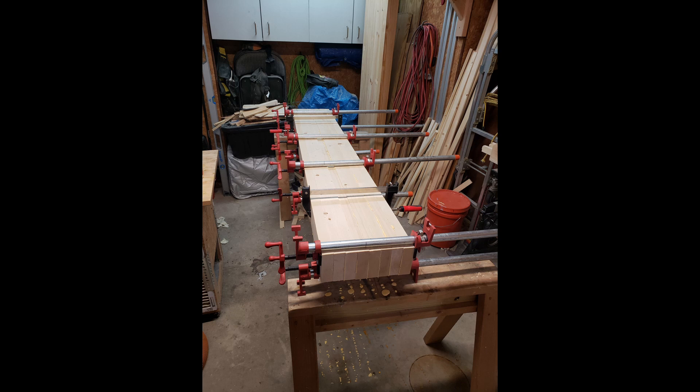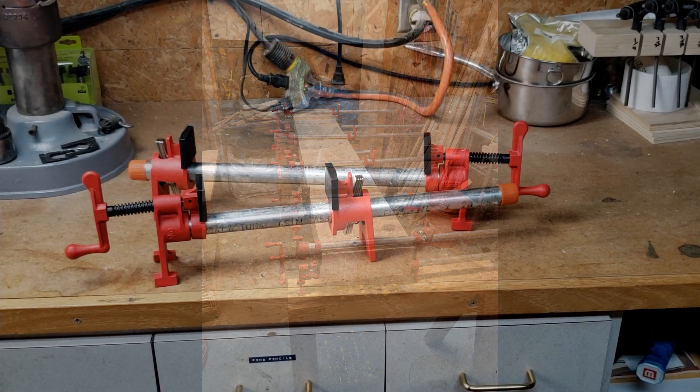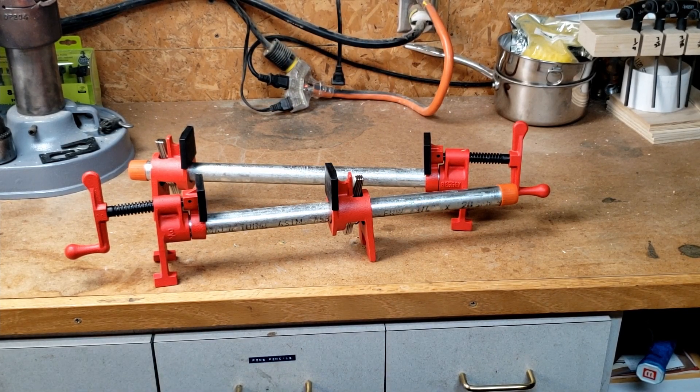However, if you are making a thick dining room table out of multiple boards, edge glued, and trying to get a good glue bond, you really want to be using some serious pressure. Another example is gluing up a laminated Roubo top — you want all the pressure you can get. The reason is the size of the glue area and the total force needed to apply proper pressure to each joint for a good bond. One thing you can't do with all those fancy aluminum parallel clamps is put hundreds or thousands of pounds of pressure on a workpiece. You could go and purchase some nice I-beam style clamps, but those are going to cost you — same with the stronger steel parallel clamps. I'm not saying every project needs this kind of pressure, but there are definitely instances where having that ability becomes very important.